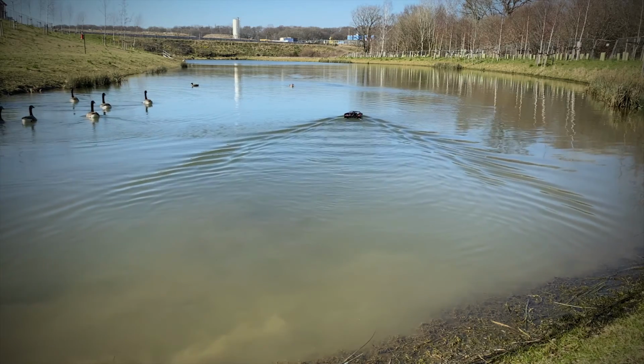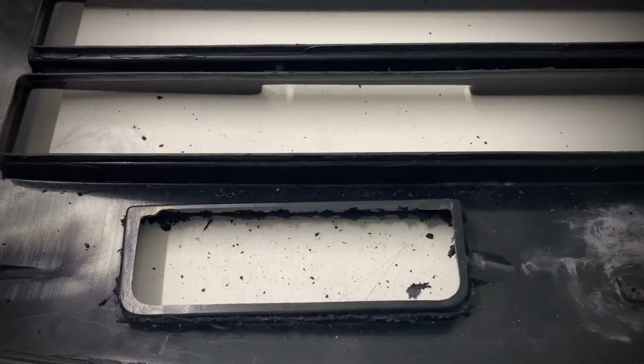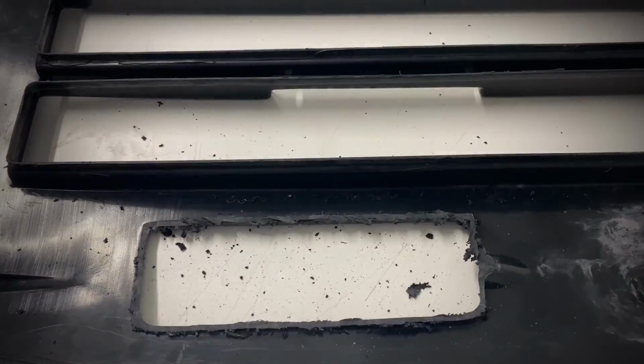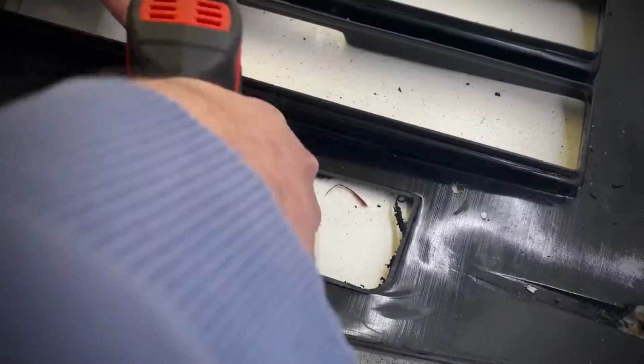Next up, as the lid was effectively going to sit over the top of the new sealed down acrylic, I went about deleting out the battery openings and the rear recesses in the lid. This was all done with a Dremel cut-off wheel and a sander to remove any material from the inside of the lid.